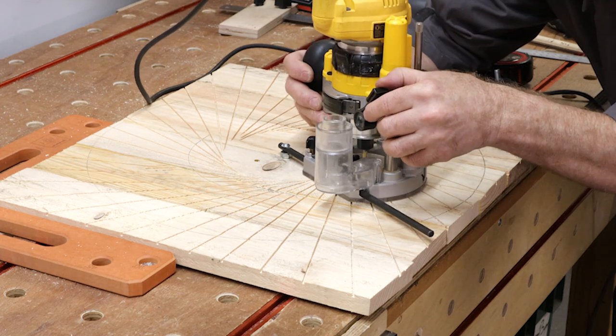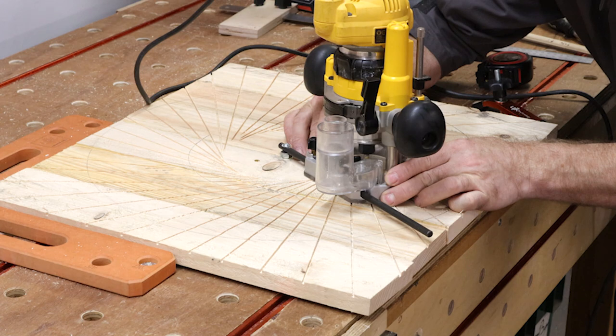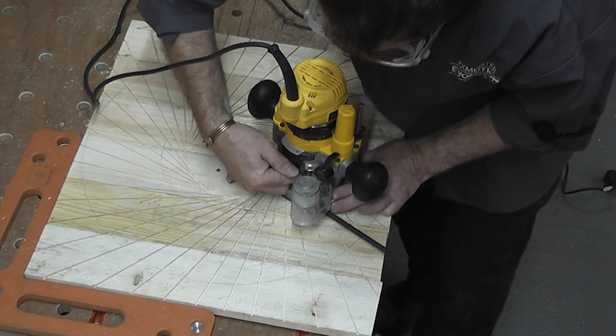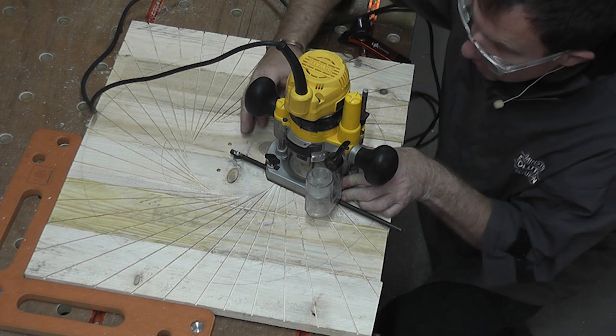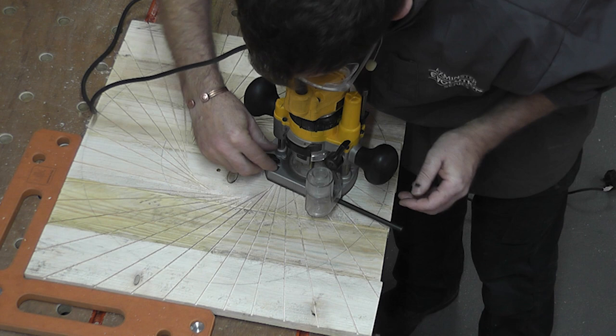Going to bring the cutter down just onto the board. Again, at this stage, you've got no power. I'm just coming out, setting up where that rail needs to be. Lock those off. Double check. So get right down, have a look at the width of the cutter. I might be fractionally over, just trying to see how much movement I get on there.